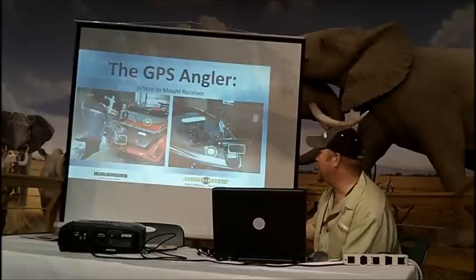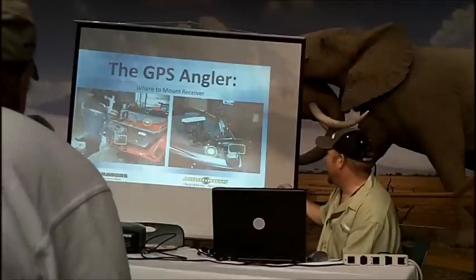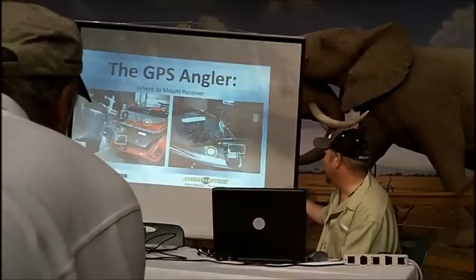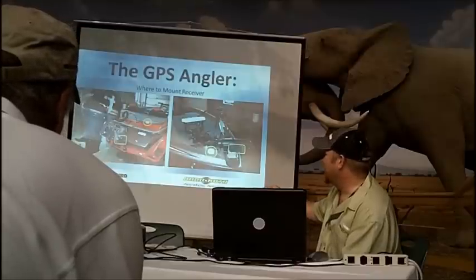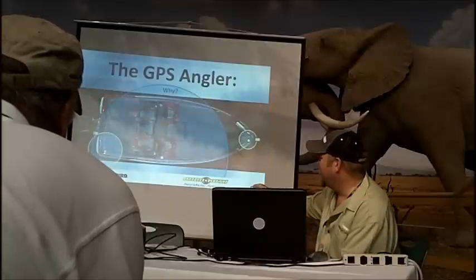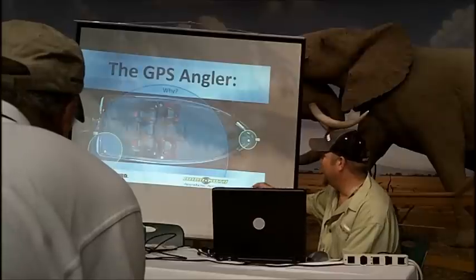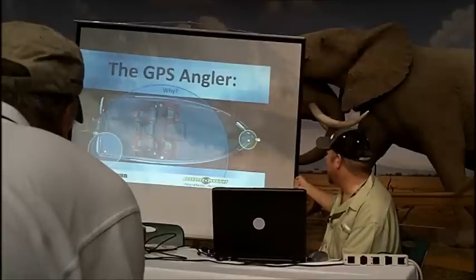This is my preferred setup and I'm going to explain why. Internal or external on the bow, it doesn't bother me because I'm looking for this relationship from the receiver to the transducer. The distance here is very close as far as a circle from it. If we look at the receiver here, here's my transducer. If I had a shoot-through transducer, it's probably going to be in this area here. I'm within probably a two to three foot circle here, maybe less. Same thing as the bow to the transducer here.